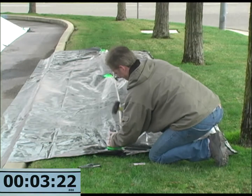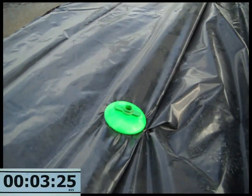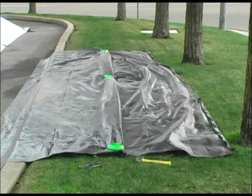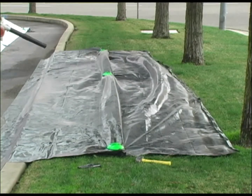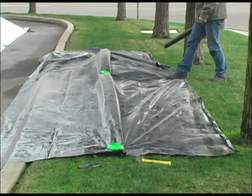Level 4 seams will take longer to construct than the two previous methods shown, but it will provide an extremely strong wind-resistant seam. This close-up shows how the double-folded seam provides an excellent air dam for use in high wind conditions. This type of seam will reduce costs when compared to other methods because maintenance will be greatly reduced and will not require heavy sandbags or tires to be moved around the site. This seam will also perform excellently in extreme conditions.